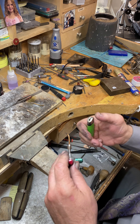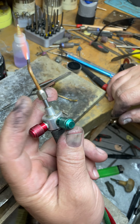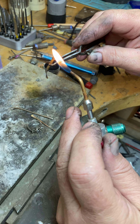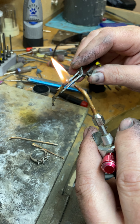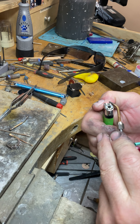We're going to start with silver first. You can see my hands on the torch — I increase the oxygen as needed. This is propane and this is oxygen. A lot of people ask: what if I just use propane? You can see that with propane alone, I could sit there for a thousand years and it's not going to do absolutely nothing. What's going to melt the metal is the actual oxygen.